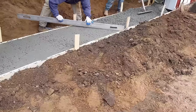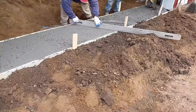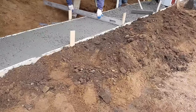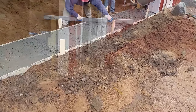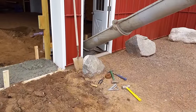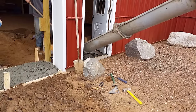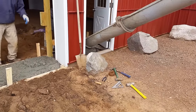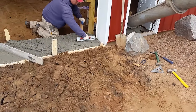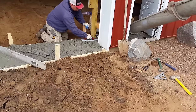I'm very pleased. The whole distance is a little under two feet — about 23 inches — so it's a 23-inch apron, and the average depth is actually over a foot deep, which is fine. We wanted it nice and strong. It's got a lot of rebar in it. We made a nice barn door pad, and then I added pavers out front. I chose not to put concrete there because I already have pavers on the other door — I really wanted the two doors to match. I found some nice landscaping rocks buried in the property, power washed them off, and my wife helped me place those strategically.